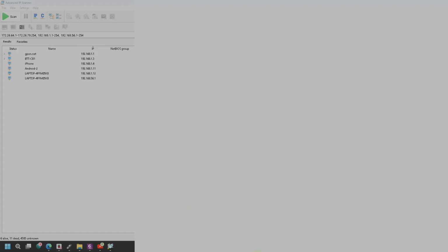When the Pi is turned on, you have a few options, like some kind of IP finder software, and you get this BTT CB1. When it boots up, it takes some 2-3 minutes. Or you can find it on your modem login page. You can find the IP just there. You can use ipconfig or similar in the command prompt. There are lots of options. I use the IP finder, scan it, and it's there. Okay, done. Then you can get it.